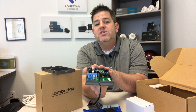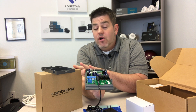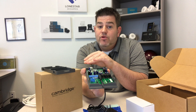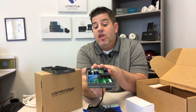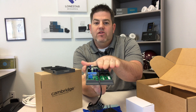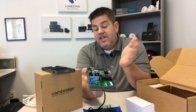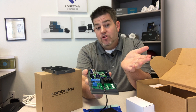This is a single zone control module, meaning everything hooked up to it will be at one volume. You can adjust the volume per speaker - on each speaker you can adjust it down 3, 6, or 9 decibels - but everything will be controlled as one volume level overall. The two runs cannot be controlled independently. The QT 300 is our three-zone control module, and the QT 600 is a six-zone control module for multiple zone setups.